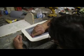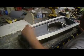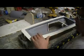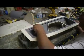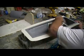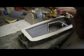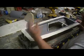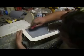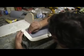You know, I like it when you put that clay under it when you mount something. When you do a flat surface like this and put clay underneath, it kind of pushes that part up a little bit, which is good. It kind of leaves you a little step right here — just a tiny one. You can feel it big time with your finger. There's a big step right there, so that when I mold my piece, when I take off that flat one you'll see where it goes. That makes it a lot easier — lets you know where you can tape it off to prime it.